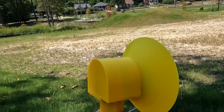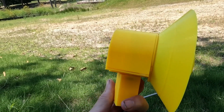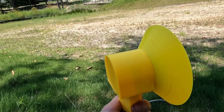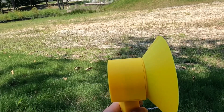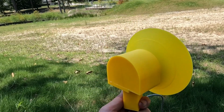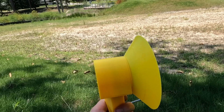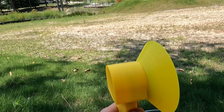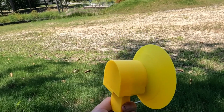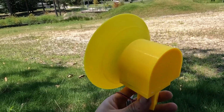Now, one of the other things that I neglected to mention is that since this uses a gear-driven rotator, and of course this is just lazily glued together so I can get back in there if I need to fix something, there's no actual clutch in there. On the regular 500 they utilize the belt pretty much as the clutch, so that if it ever gets caught in really high winds, the belt will just slip. But since this is gear driven, you really don't want to force the head on this thing. If you need it to rotate to be more presentable in whatever diorama it's in, you just have to give it a little bit of power to get it to spin around where you want it. There's really no way around that that I can foreseeably think of, because it's a flaw inherent with the rotator design, at least of this model specifically.